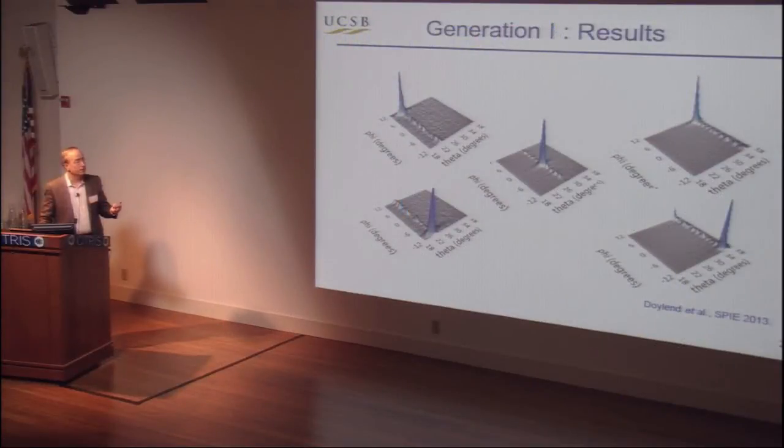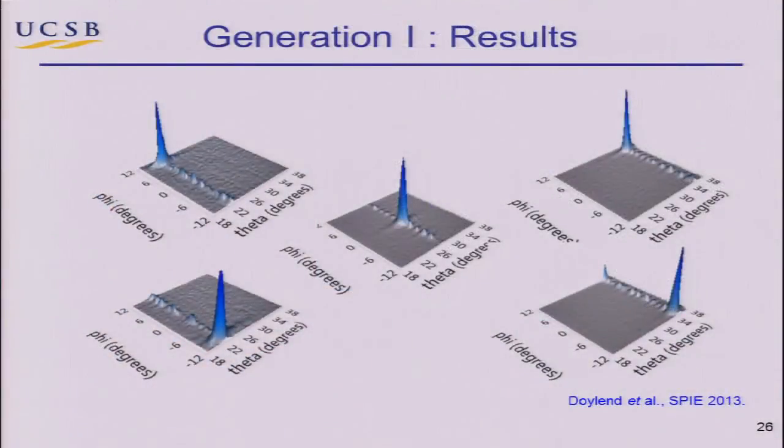This is a 16-element one without the laser integrated. And so this is with all the light centered in it here, and then this is the grating direction, so you get very good low side lobe level. The other direction, this is the 16-element phased array, and you do see side lobes. And of course, that comes because we have uniform spacing. So we are looking at, and Jared talked about in his talk last week, other spacings so that the grating side lobes are much smaller.